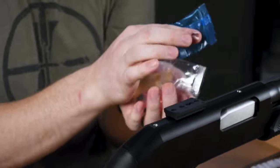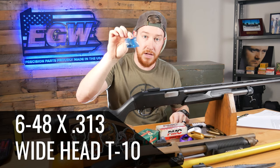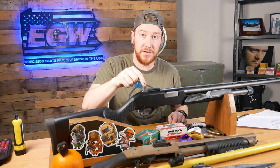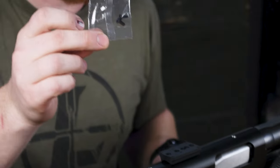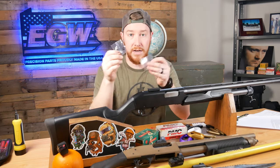You're going to get some fun bags of screws when you open up the mount. The blue bag contains 6-48 wide-head screws — if you have 6-48 threads these will work. They're wide-head because the holes are drilled for number-eight screws, so the wide head of number-six screws gets a lot of engagement. The clear bag contains button-head screws for the optic; there's also a flat-head option for the optic. You may not get both — it varies depending on which optic footprint you choose.